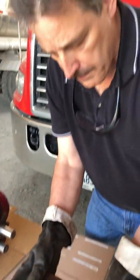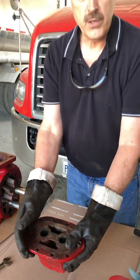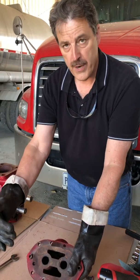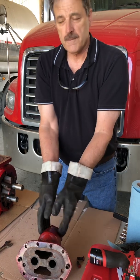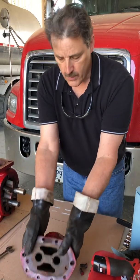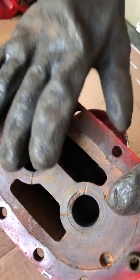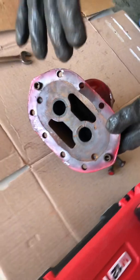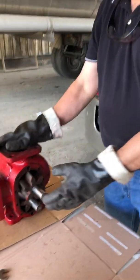If there was a break or a block in the line, this pump is designed to recirculate within itself. The problem is that a lot of times drivers don't make sure the pump is cleaned at the tank wash. The only way to properly clean this is when the tank wash shuts the pressure side off while still putting product into the pump, forcing the bypass to open. This is important because if you had a heavy product like a resin, it would get in here and gum this up — and over time would actually harden. Make sure they open this up manually when washing the tank by shutting the pressure side off and letting the inlet side pull the product in and force it open.